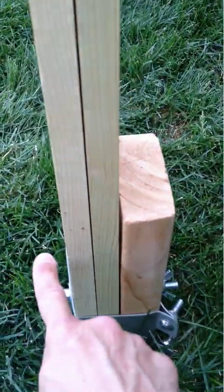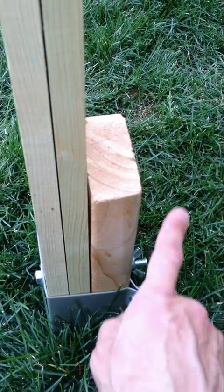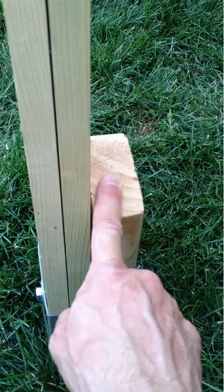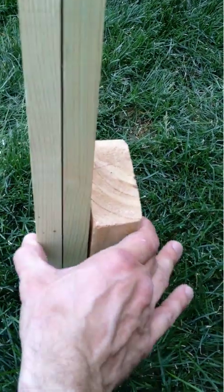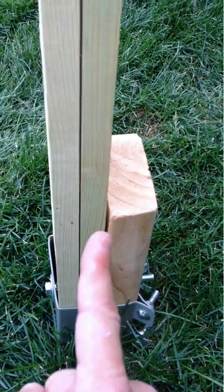So now we've got 2 inches of wood in our 4x4 post anchor. So you go get yourself a scrap piece of 2x4 from the same lumber store. It'll probably cost you $1 in their scrap lumber bin. So now we've got 4 inches of lumber by 4 inches of lumber. Put it in there. In theory, it fits perfectly.